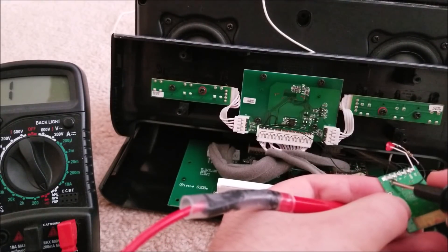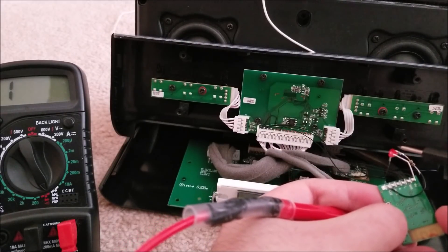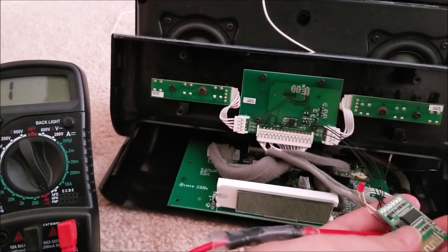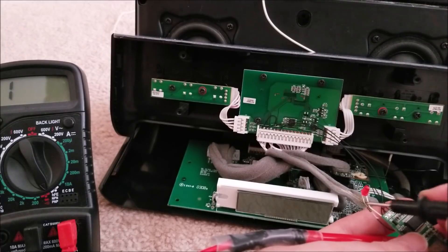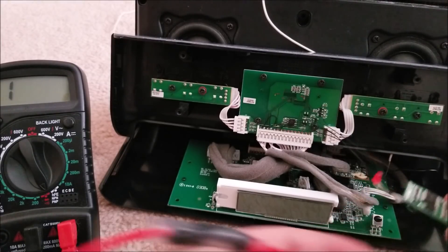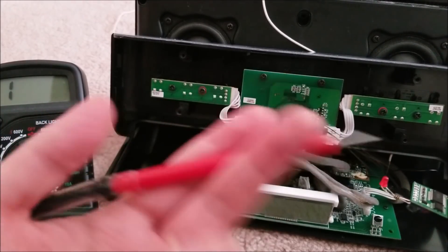Additionally, I grabbed the LED pin, which is an active-low pin. I hooked that up through the resistor to the negative input of the LED, and then the positive just goes straight to five volts. It's pretty dim at 100 ohms - I could decrease that if I wanted it brighter - but since I'm going to make this battery-powered, I don't want it blindingly bright anyway.